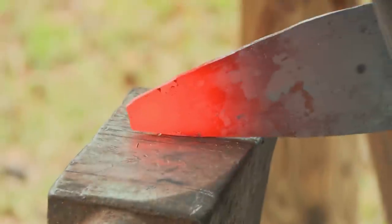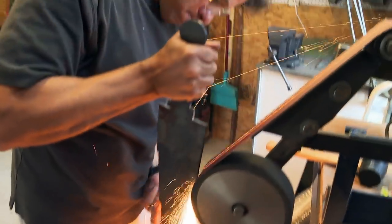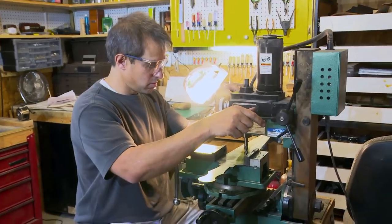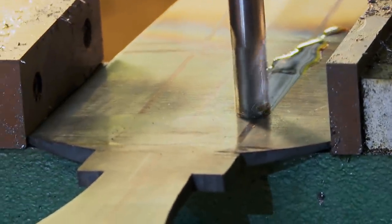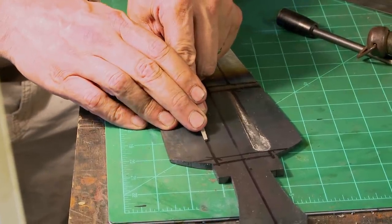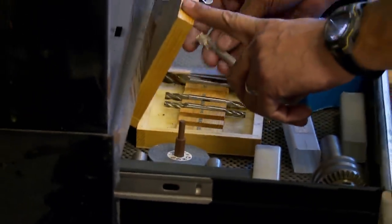It's day three. Having to cut a hole in the back of my forge took some time, but I feel like I made good progress on the blade — I've got it profiled the way that I want, and it feels a lot better in the hand now. Now it's coming to the most challenging part: putting in the fullers. I've got the blade in the mill, but the milling bit is just skating right over the surface — polishing, not cutting. Option B is to try freehanding it with a file, but the file is just dancing over the surface of the blade. Option C is to try to freehand it on the grinder — that just looks terrible. This is like a perfect storm of anxiety, doing something for the first time that's very challenging. $10,000 on the line.